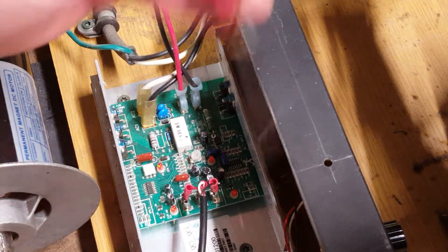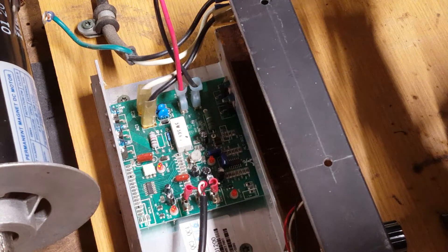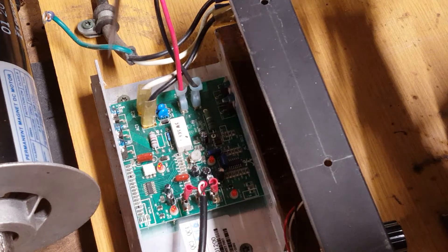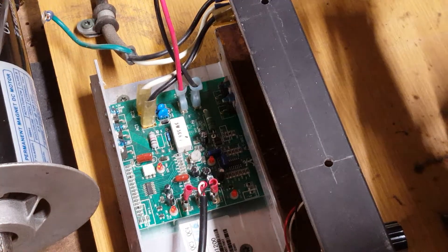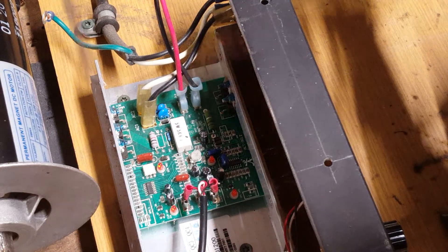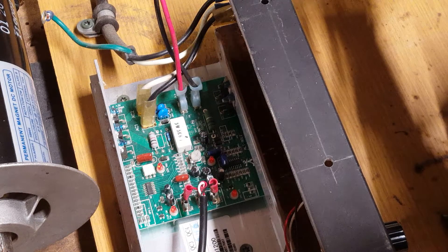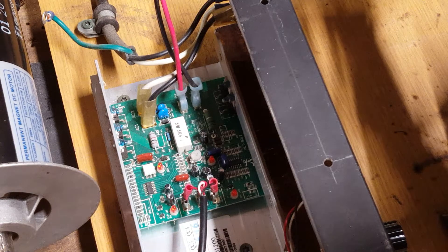This is basically the simplest wiring diagram to get a DC motor to power up and be variable speed — with the thermal brake option and the ability to switch wires for reversing direction. For other applications like a DRO where you want to move backwards and forwards you can make this more complicated, but this is just plain basic MC60 board. The treadmill cost me about $45, I got a three to four hundred dollar motor, an MC60 board, enough metal and hardware you can see I've built other stuff with — nuts, bolts, high-grade fasteners, and a piece of phenolic board the belt runs on.